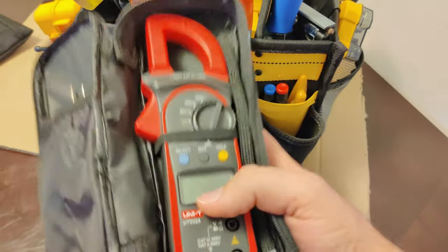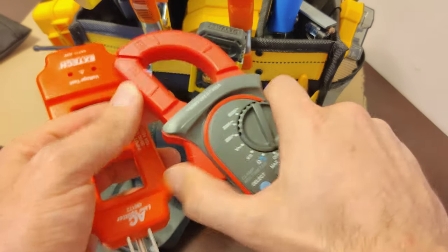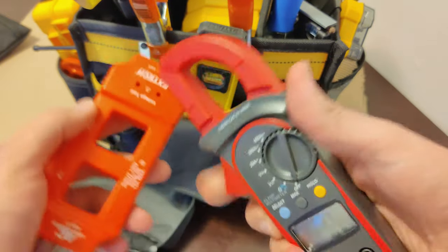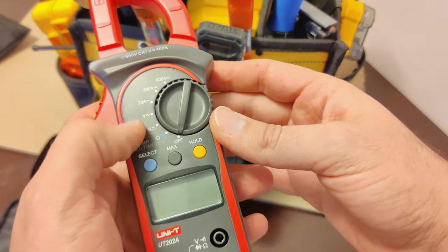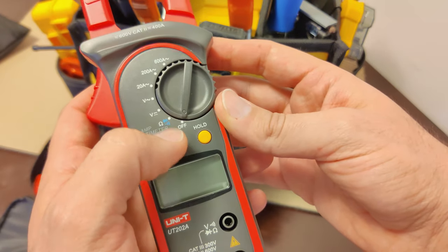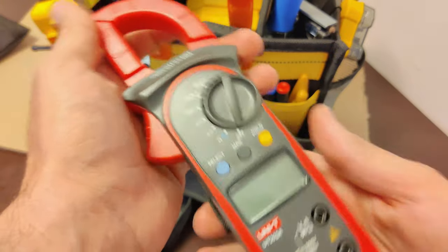In this pouch I have my amp reader clamp — so it's a multimeter as well, not just for amps. This can measure current via this clamp, and I carry this AC line splitter with me so that I can split the AC lines and measure the amps that way. In addition to current, this can also measure DC voltage and AC voltage, resistance, test diodes, and do a continuity test as well. So it's a really nice tool to have. You've got to have something like this if you're planning to do anything electrical.